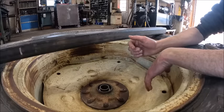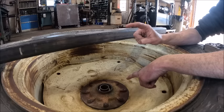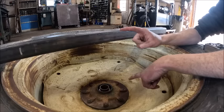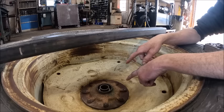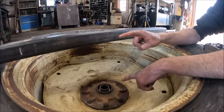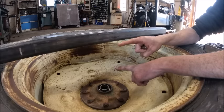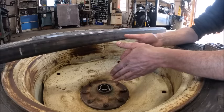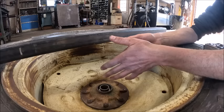because the center of the rim is offset to the outside. So we add the, what is that, an inch and a half? No, 2 1/2. Right? Because 7, 8, 9. Yeah, 2 1/2. We add that to the length of the H-beam, and then we're going to have to subtract the thickness of the end plates we're going to cap it with, which I think we're probably going to go with 1/2 inch, so subtract 1 inch. And that will give us the length of our axle that we need to cut.